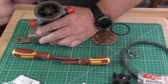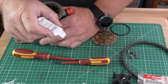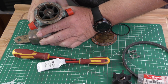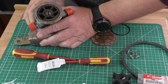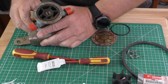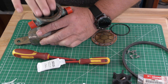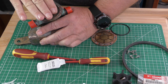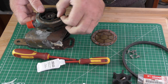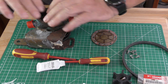They won't come off, they won't go up the pump into your heat exchanger, providing you use lots of this impeller lubricant or washing up liquid, Fairy liquid. What will happen is that they will do exactly that. Look, no damage at all. Okay, and you saw how easy, without any lubricant, it was for me to put this in by simply getting it into the right position and then pushing it down. And then the next thing that happens is the O-ring goes on. Again, lots of lubricant on there. It will hold itself in position, look.